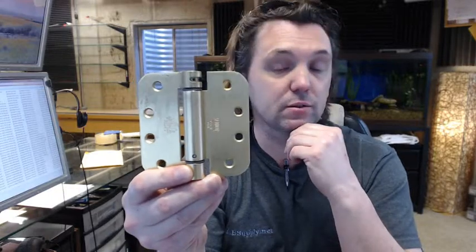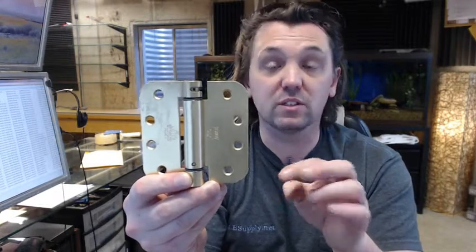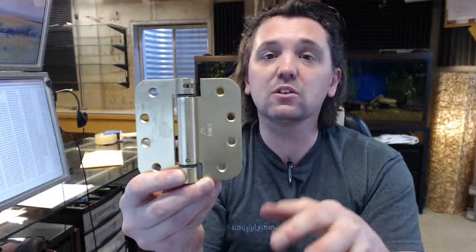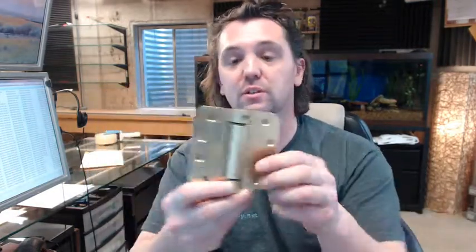Now, I'm a fan of all spring hinges all the time, and it's not because I like to sell spring hinges, which I do, but they're relatively inexpensive. But having installed and maintained spring hinges over the last 2+ decades, I can tell you that you get greater success out of a door successfully closing and latching when you've got more spring hinges rather than having less spring hinges. With 1 spring hinge when you need 2, or 2 when you need 3, or 1 when you need 3, you've got to really set the tension high on that spring, and we'll go over that in a moment, to get the door moving quickly enough through its closing cycle to overcome the wind resistance, air pressure, and the friction of the latch as it hits the strike of the frame to get it to successfully close and latch.